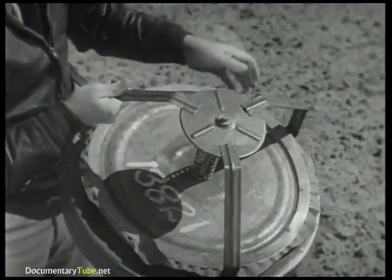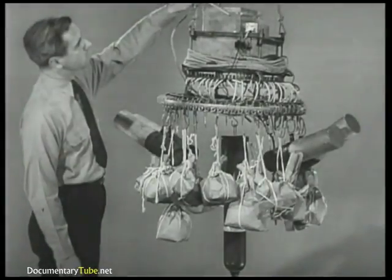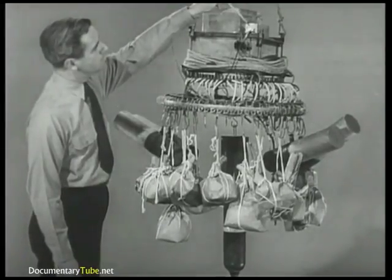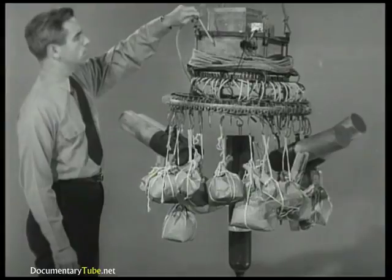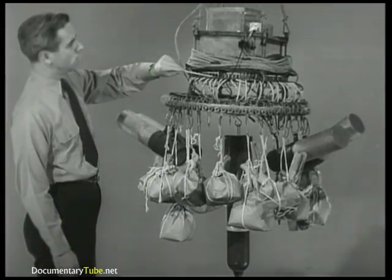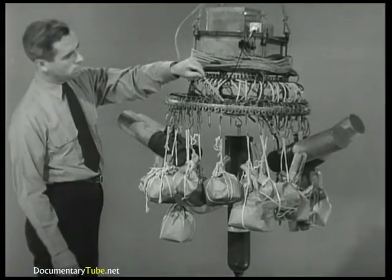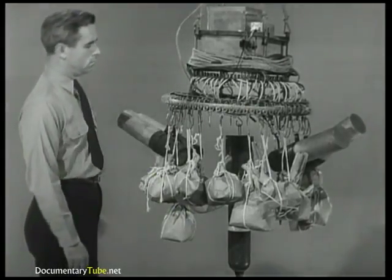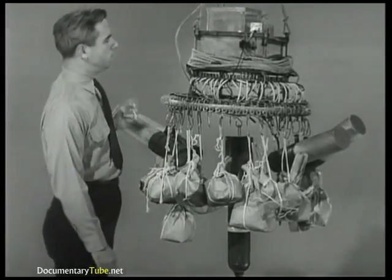This is the business end of the balloon — an extremely ingenious device for maintaining a fixed altitude of 30,000 feet and for dropping the payload. It consists of an electrical source, a demolition block, a box containing four aneroids, fused jacks, switches, blowout plugs which support the bags used for ballast, incendiaries, and a central payload.